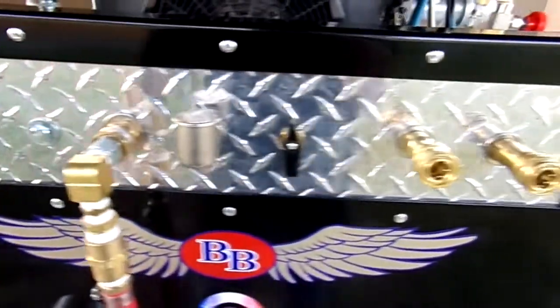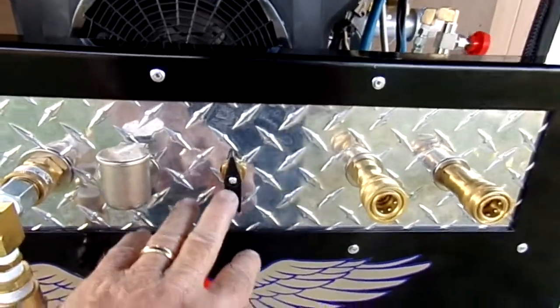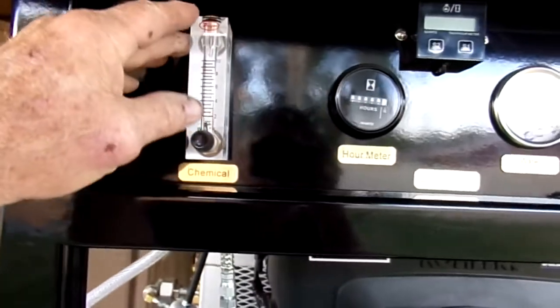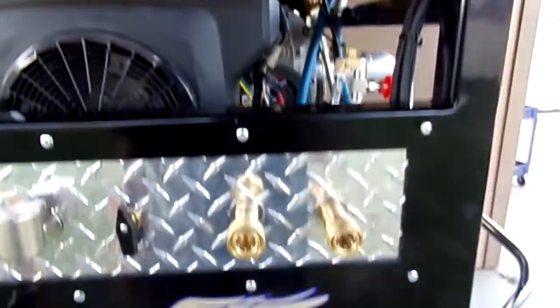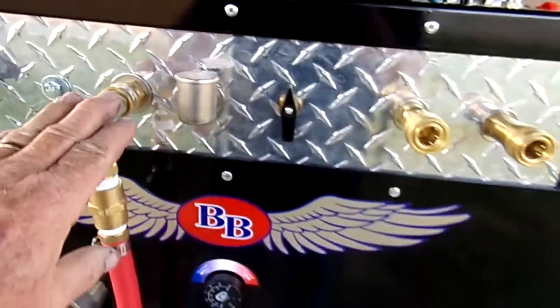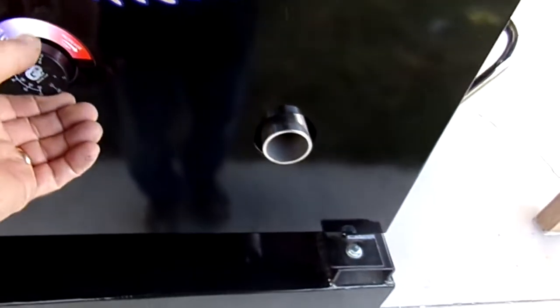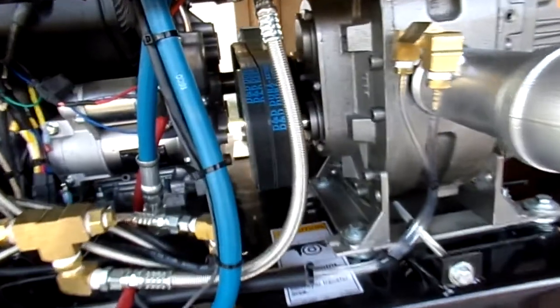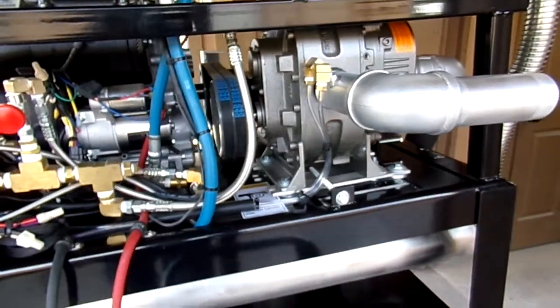You want to be able to get to everything at the same time. You've got two ports here — one could be for your pre-spray and the other for carpet cleaning. You've got your last step injection primer pointing up to your acrylic GPH flow meter, which adjusts with this ball valve how much chemical you'll be putting into the system. You also have a gravity feed for your WD-40 to protect your lobes. You've got your water inlet, your thermostat — a gradient that tells you to go left to decrease and right to increase. We have a built-in circulatory system to give you perfect regulation all the way around, and dual belt B-size pulleys, cog belts, which means they run cooler, with better gripping ability and low shed.